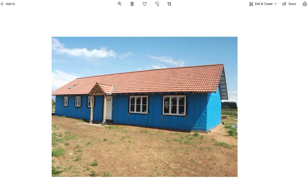So this is what our timber frame house looks like from the outside. You can see it's fully built here. You could actually live inside the house here. You've got your breather membrane that you can see outside the timber panel. Windows are put in, roof is in place. So this is our timber frame, and then we come along and we put an external skin outside. So you've got a choice. You could put an external skin of blockwork, which is common in Ireland because of our harsh weather. So a lot of wind and rain and snow and ice in Ireland. So you can put a skin of blockwork on the outside of this house, or you can put cedar cladding or some type of timber paneling on the outside.